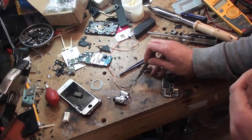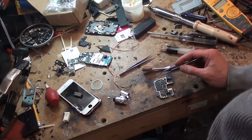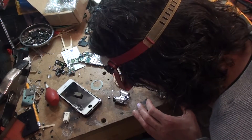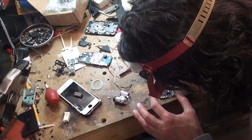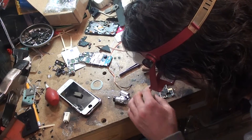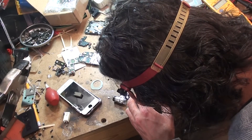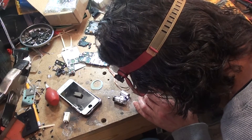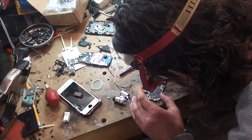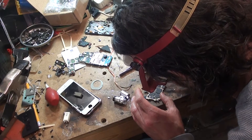It has several pins on the bottom. The idea is to desolder — I should have videotaped that part but I didn't, I apologize — pull the power IC out and reinstall the new one. Make sure you pay attention to the orientation of the chip. Pin number one is supposed to be over here, so I'm going to turn this around completely. Pin number one is marked on the IC — there's a little round dot right here which indicates pin number one. You just want to lay that nice and flat.